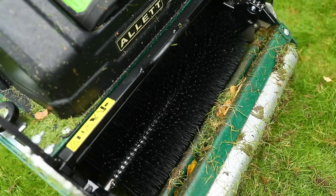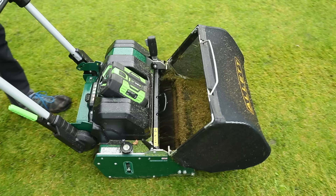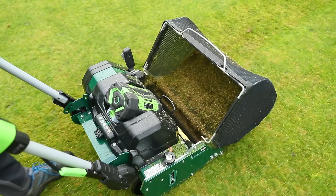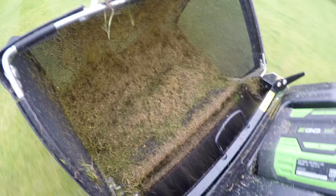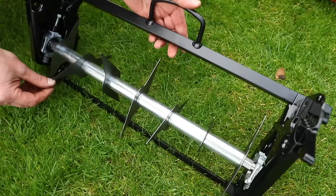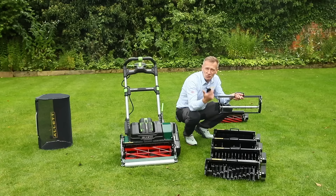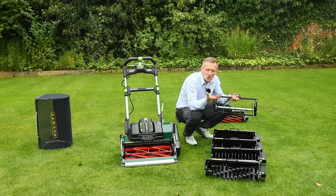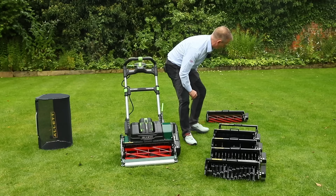There's a new denser brush for the Stirling, great for removing and levelling worm casts, incorporating top dressing into the sward, and levelling a cricket wicket. There is also an aerator cartridge — this one is not driven and has no pulley, so if you have a particularly delicate thatch situation it's the safe starting point. It simply rolls as you drive forward, putting small spikes into the surface to allow water through and start reducing the thatch layer before progressing to more aggressive cartridges.